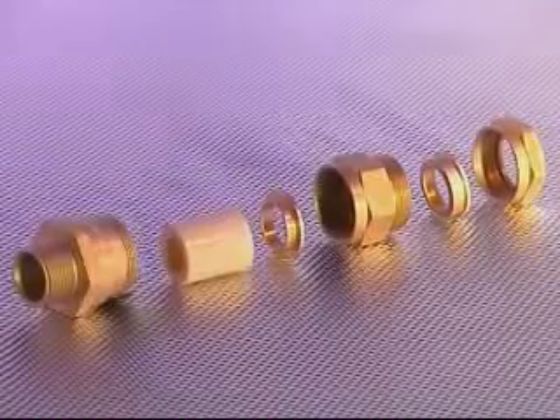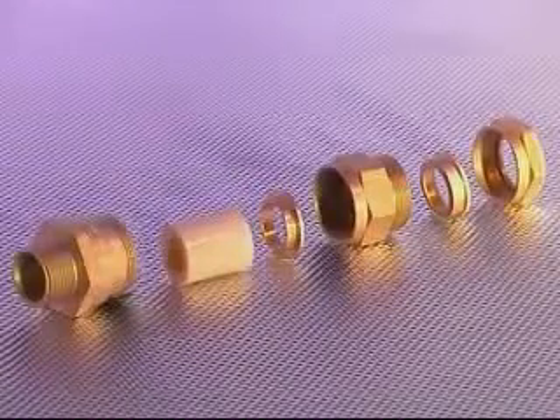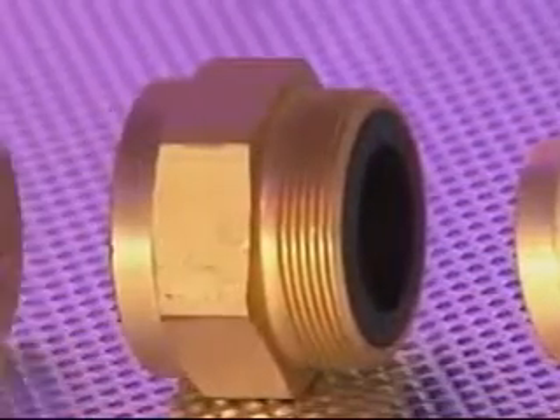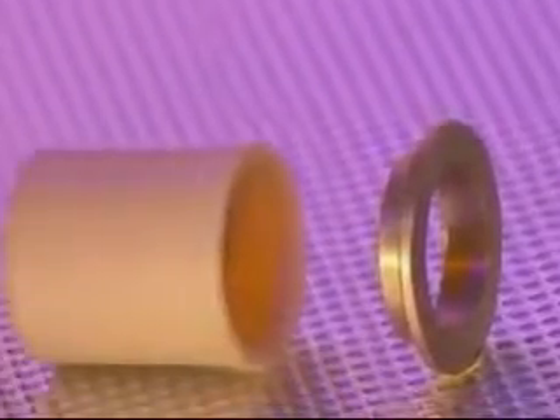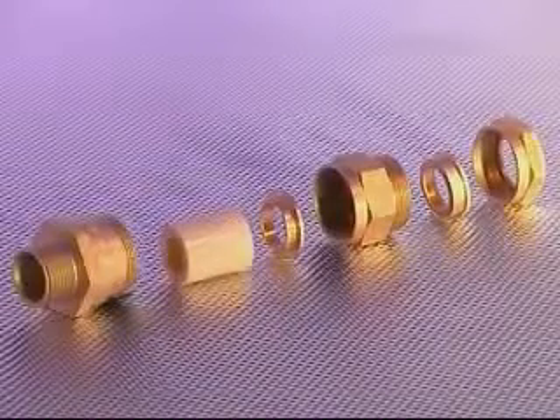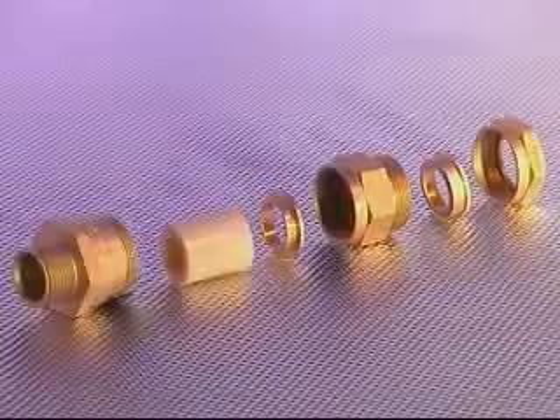The ICG-623 comprises six major components: the back nut, rear compression spigot, middle nut incorporating seal, compound spigot, compound pot, and entry component. This type of gland is specifically designed for use with non-armoured elastomer and plastic insulated cables.